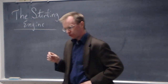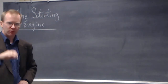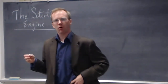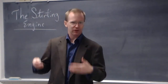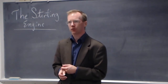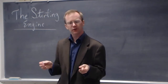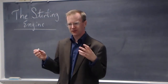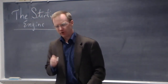And the Stirling engine has, in principle, a very high efficiency, and because it's run at low pressure, or close to atmospheric pressure, building one doesn't require the very fine tolerances around the piston that steam engines or gasoline engines do. So hobbyists in this era have had a whole lot of fun building them themselves, sometimes machining parts out of metal in their home lathes, but other times building them out of spare soup cans or plastic syringes and test tubes. You can build Stirling engines in a lot of very simple ways. I'll give the basic design here and then I'll show you one.